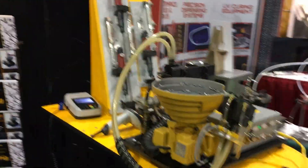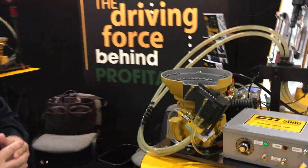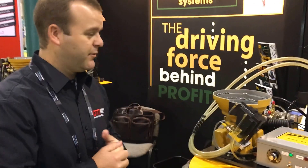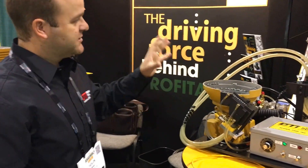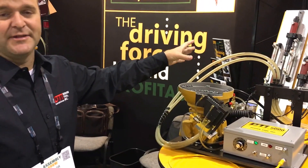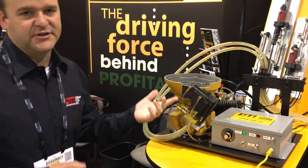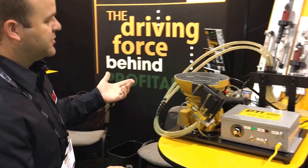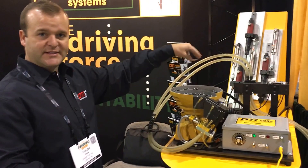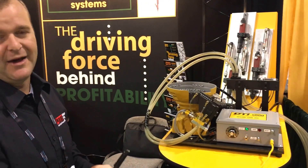What if I want to buy a turnkey system with just components from you? We do that as well. We can feed and drive really as many screws as you would like to. What we would do is have your bowl feeder feed to mounted screwdrivers onto a platen system that can be mounted onto a robot or linear actuators. This one's set up to feed and drive four screws at one time. We've got a double feed mechanism here — it's going to feed two at a time and then blow all four at one time to be driven simultaneously by four mounted screwdrivers.